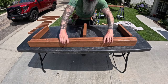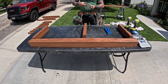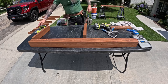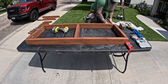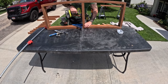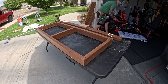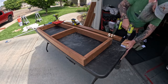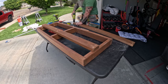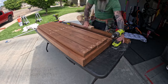Moving on to assembly, we're going to start with the seat frame. Grab two of the 52-inch boards and three of the 16 and a half inch boards. In the 16 and a half inch boards, drill pocket holes on both sides of all three boards and then screw the frame together. I'm using a pipe clamp to make this a little easier — if you don't have one, it's not a huge deal, but it does make the process a little faster. After that, we're going to install five of the 51-inch boards for our seat. It's really important that all the screws line up, so I pre-drill and countersink all the holes. I grab a scrap piece of 2x to use as a jig for drilling the holes, which ensures they're all in the same spots and speeds up the process.